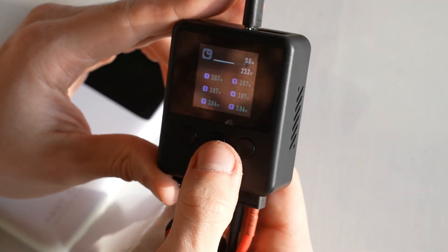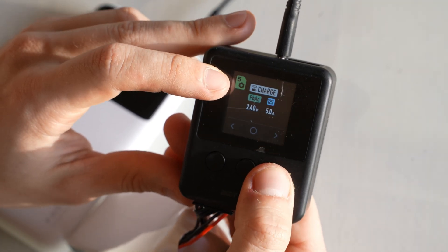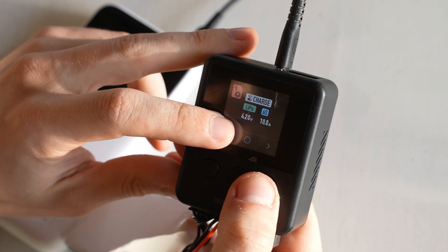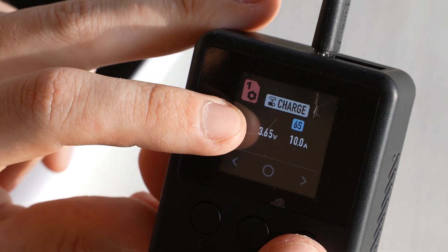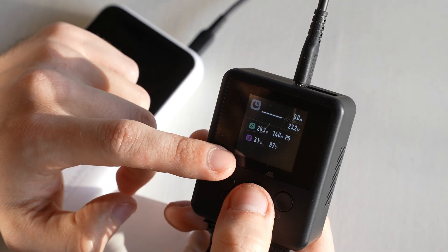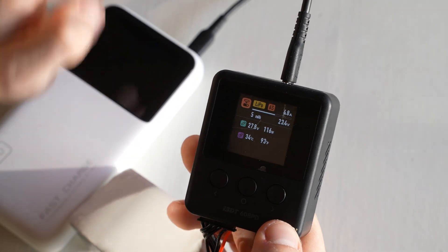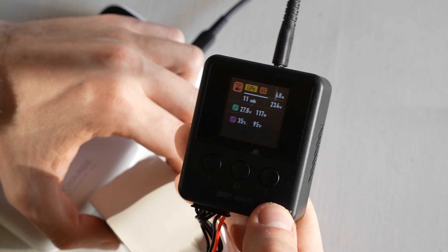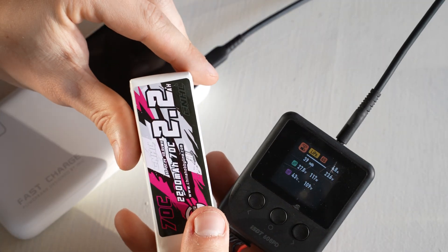It's a full-fledged charger in a very small form factor. If you go into the charge menu with a long press, the menu system comes with presets that you need to create. Creating them — even with three buttons — is a little involved, but it goes all the way up to 10 amps, which is monstrous. You can fine-tune the charging voltage and select battery chemistry: LiPo, lithium iron, lead, nickel metal hydride, or LiPo high voltage — even 1S batteries. After saving the preset, the charger is smart enough to cap itself at the maximum power available. Pulling 10 amps at 20 volts would be 200 watts, but with 140 watts input it limits to about 5 amps, still charging at more than 2C, so it won't take very long.